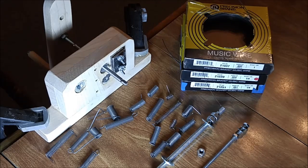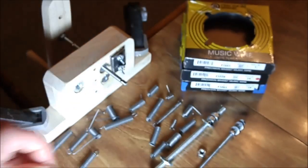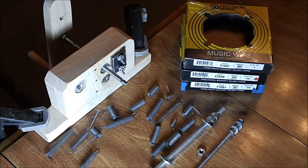After using this prototype jig to make a number of springs, I have some improvements and limitations to share. The T-nuts on the crank handle side are not really necessary — having them can lead to threading issues if the T-nuts on both sides are not exactly aligned. Instead of using bolts, you could use threaded rod stock, which would allow you to make longer springs — as long as you wanted. This jig only makes right-hand wound springs. Also, the spring diameter is limited to the mandrel bolt diameter being used; larger diameters of the same winding pitch are not possible with this jig. I plan on making an improved jig in the future that resolves these limitations, but even so, this is a very useful jig that I plan to use on upcoming projects.